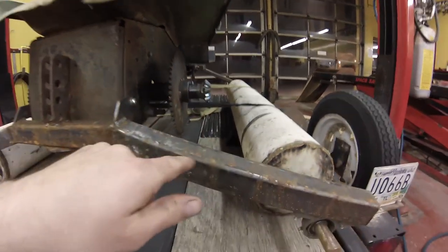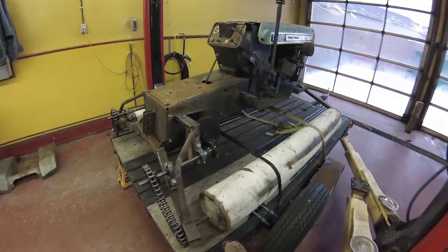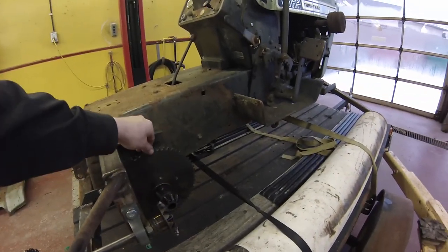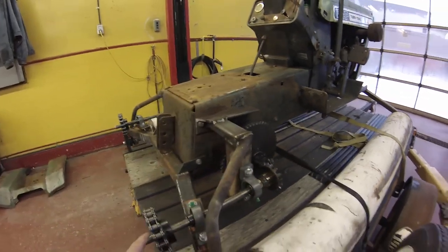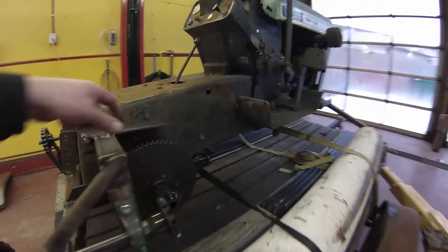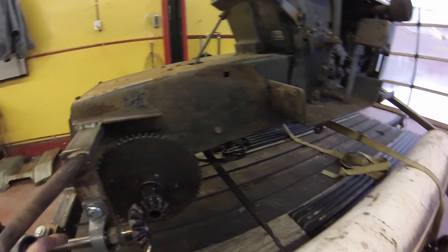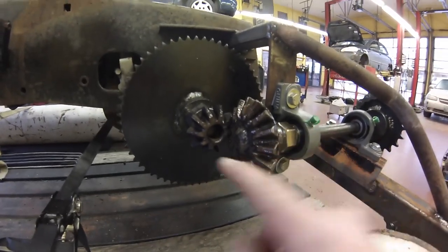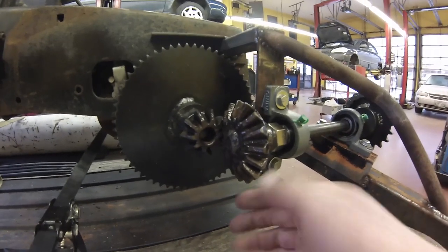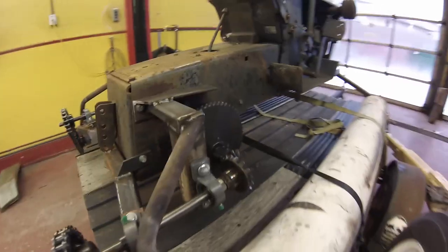I'm going to get the shafts running back to the screw. Here is the semi-finished product on the drive system — you can see I have my drive gear mounted to the axle, the driven gear mounted to this jack shaft, and the chains going down to drive the augers. Everything's looking pretty good. This is going to be the brake disc — I'll probably cut these teeth off and maybe mount a caliper somewhere to give me my steering. You can see how the spider gears are working. They're fully exposed with no lubrication, so I'm not sure if they're going to last — I'm hoping to put some kind of box around them with grease, but I'm just going to try it like this to see if it works.